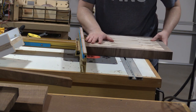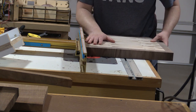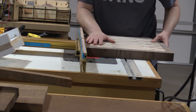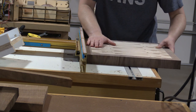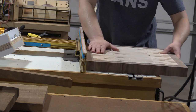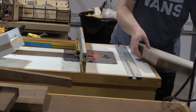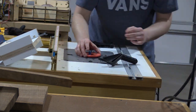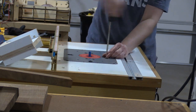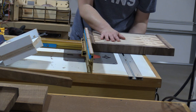Since this board is going to sit over a sink, the juice grooves are a little unique. Instead of four grooves all the way around, I'm just doing two juice grooves down both of the long sides so that any juices can actually drip down into the sink. This made the juice groove process a lot easier. I'm switching to a half inch flat bit to router in edges on the bottom of the board, creating a little lip so the board sits over the sink nicely.